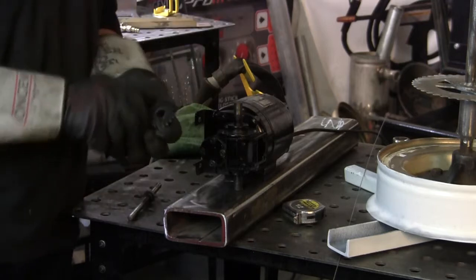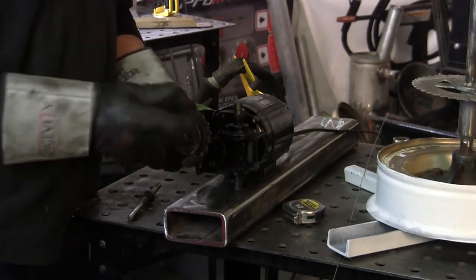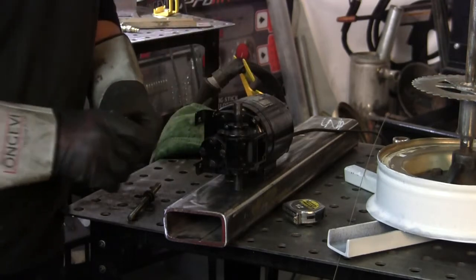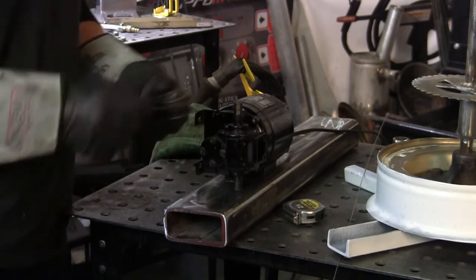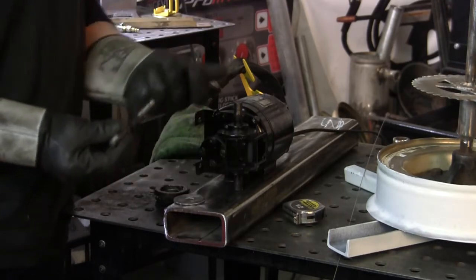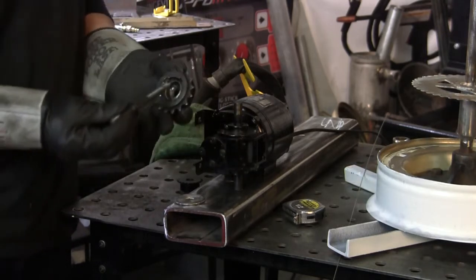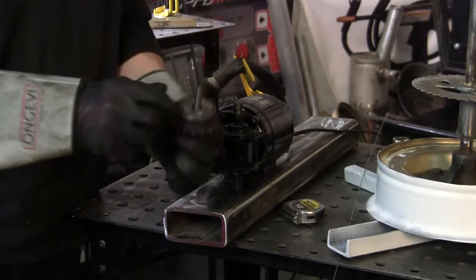What I'm going to do is put this other sprocket on. The sprocket is actually from a bicycle too, and what I like about it is it'll go one way but lock the other way — so you can tell when you're going right or left and it won't go a direction you don't want. To keep everything nice and centered, I take the axle from the back of the bicycle rim because it's got the race on it. We take the old gear and position it where the sprocket holes — where the spokes used to be.